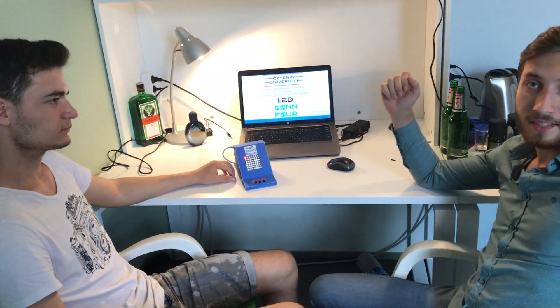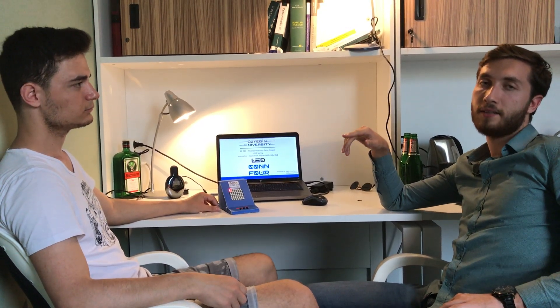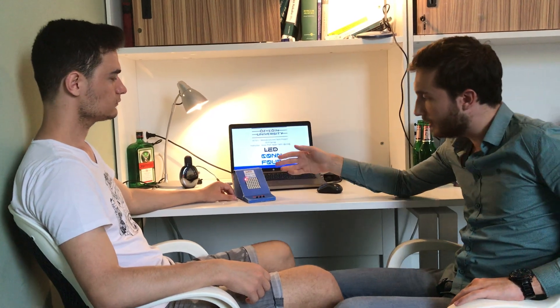As Mohamed said, the most challenging parts were disassembling these parts. We made a short circuit after disassembling the LEDs by connecting the first pin of that LED to the fourth pin, so the Arduino doesn't recognize that there is an LED — there is no address for it, so we can literally skip it. This makes one NeoPixel array with eight LEDs become seven LEDs.